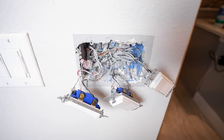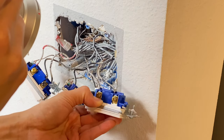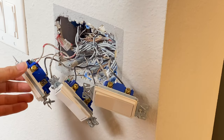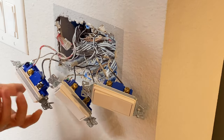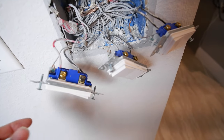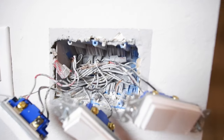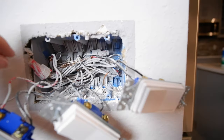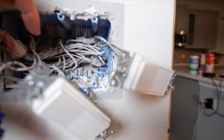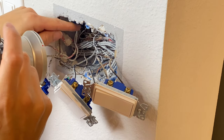Taking a look inside: we've got three switches. These two are regular switches — they basically just have two lugs for the hot coming in and a ground, as I discussed earlier. Over here we have the three-way, which is a little different — there are three lugs for power, usually two golds and a black, indicating which is load, line, and pass-through. You can also see the green copper ground. My house is 2017, so you'll see a bundle of black wires for the main line, a bundle of white wires for the neutral, and bare copper for the grounds.